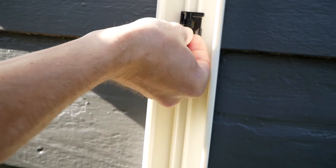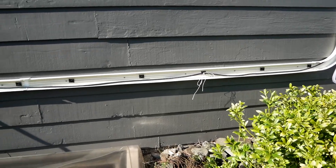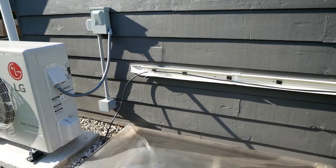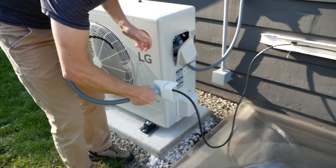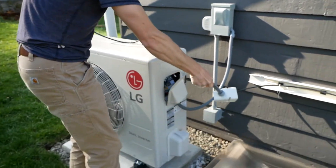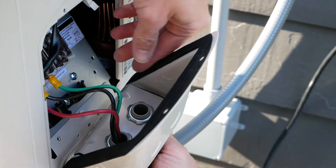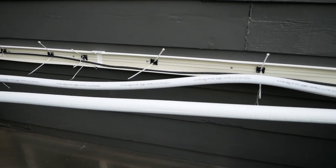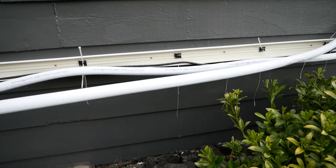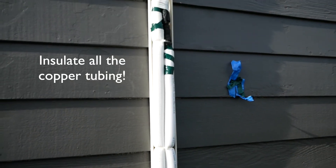Slide one cable tie clip about every 20 inches. I then laid the electrical cable in loosely with some string. Make sure to use liquid-tight connections for the conduit housing the cable — I ended up using the 90-degree fitting later coming out of the track. Next, I installed the line set. I'll have another video on how to flare the copper tubing and make the connections. Then you zip tie it in and it's ready to be covered.